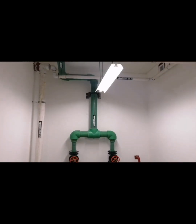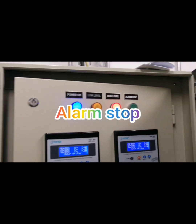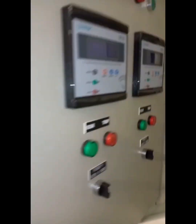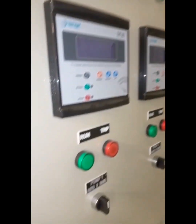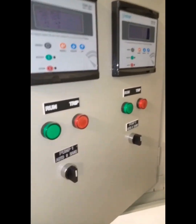You can see there is a high level alarm — you can see this and listen to the sound. There is a proper installation for pump one and pump two. We are now making the alarm silent; there is one button you can push inside the panel to silence the alarm. You can see there are a number of connections — one for pump one, another for pump two, and the rest for the four float switches.